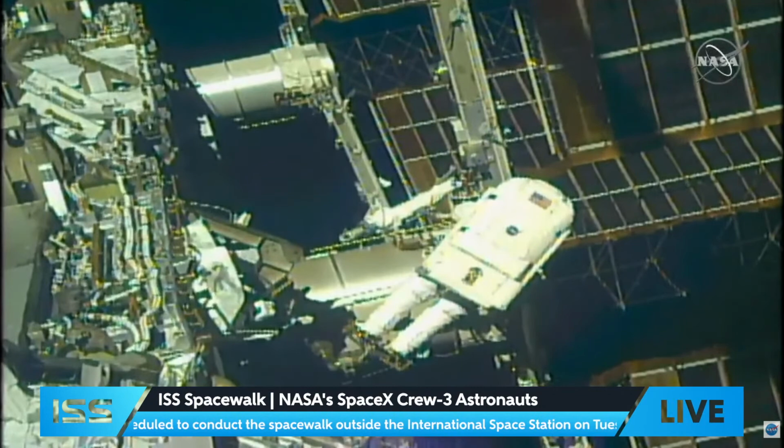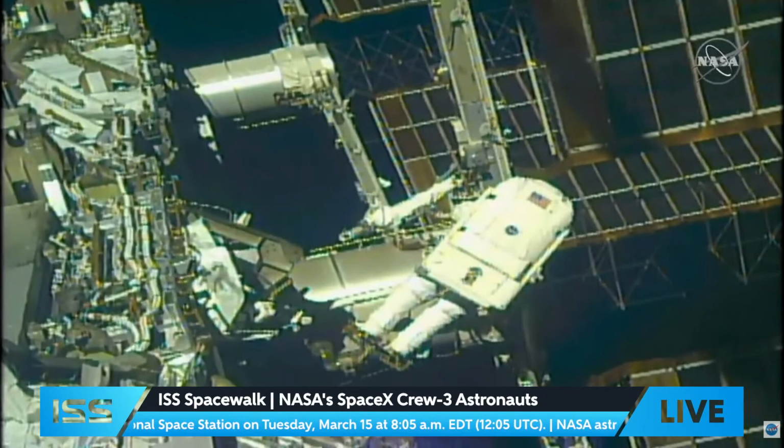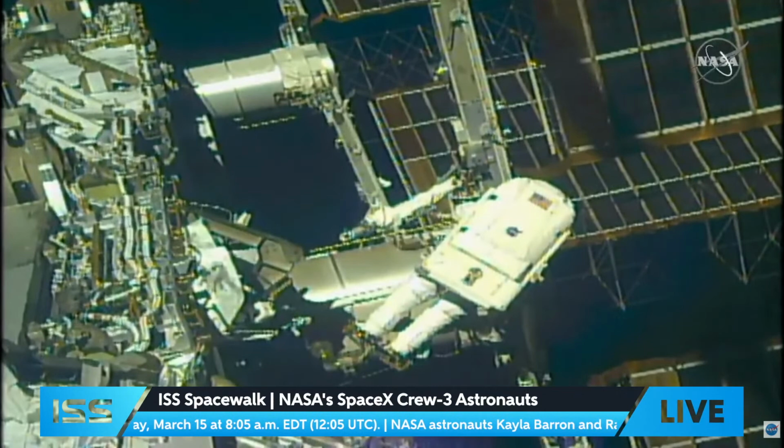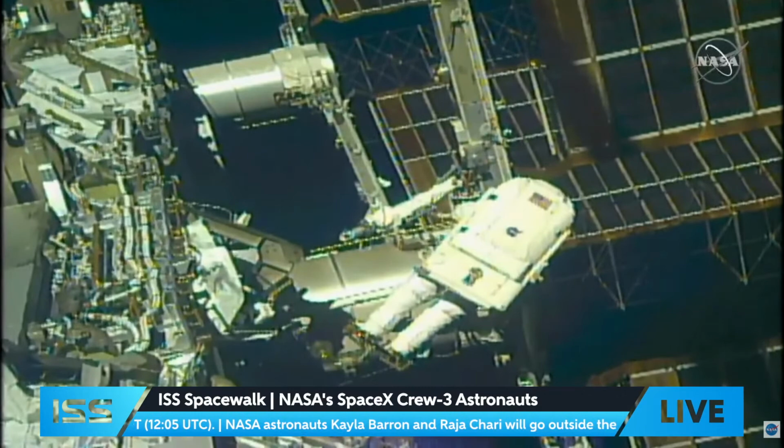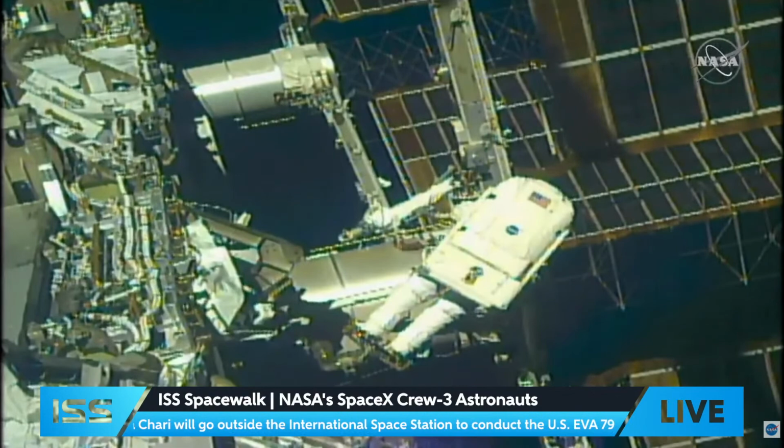Line looks parallel and flush. There's maybe a tiny bit of metal still showing, so maybe not, like I would say maybe a millimeter. Okay, the black line is a millimeter. About a little over one additional turn, and about a millimeter between the black line and the bolt cam. Hey, stand by, we're checking. Okay.